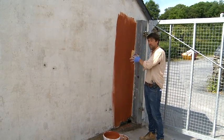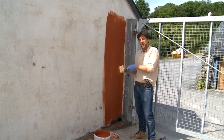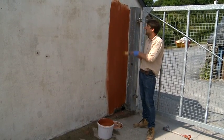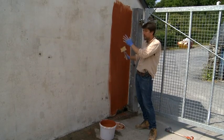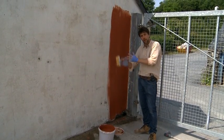If the sun was to hit this now, it would dry it out too quickly, and then you've got the challenge of keeping it damp and moist. But of course you can't spray this down because it would just wash off. So you'd have to think about protective measures — hanging hessian at a distance from the wall, not touching it, just creating that damp microclimate.